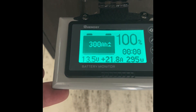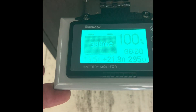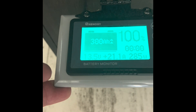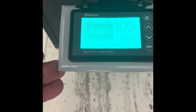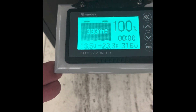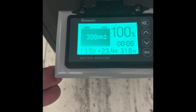I'm going to leave the converter on all night and see what kind of charge I get with this 8955 AD. After only about 15 minutes on the converter, you can already see the amperage starting to drop — we're at 23.4 amps now, down from close to 25 when we first turned it on. We're showing 13.5 volts going in, which again is not the type of charger you want for lithium-ion batteries.